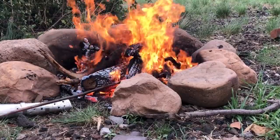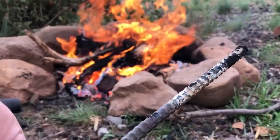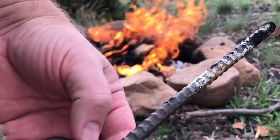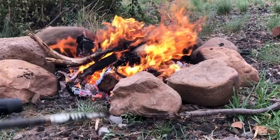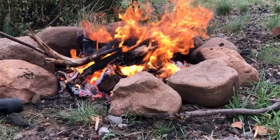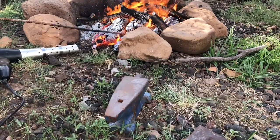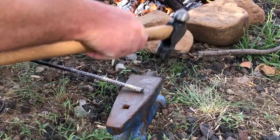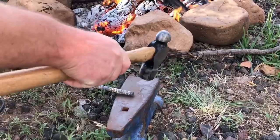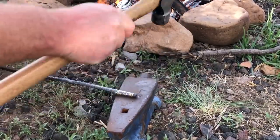The workpiece is a piece of 3/8-inch rebar. You can buy this stuff — I've seen it as cheap as $3 or $4 for 20 feet at Lowe's or another home improvement store. A lot of times you can find it laying around. This was probably a property stake that wound up in a junk pile. When you start out with a piece like this, similar to 3/8-inch round stock mild steel, it should have similar characteristics when it comes to forging or smithing work.